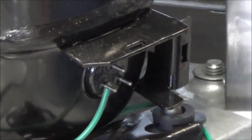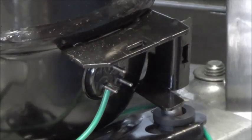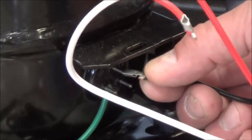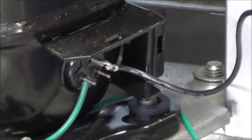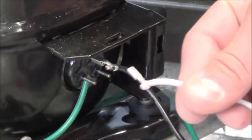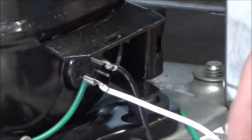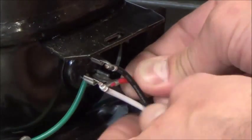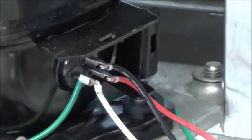Every 3-in-1 hard start kit gives you a wiring diagram. It says that my Common is going to get the black wire — Common is the one in the middle, so I'm just going to attach that right there. My S is going to get the white wire, so I attach that to the compressor and push it on. Then it says R gets the red wire — I tape that on there, push it in, and we're good to go.